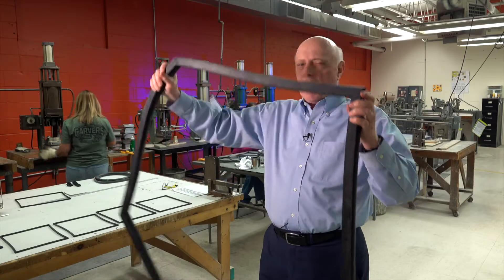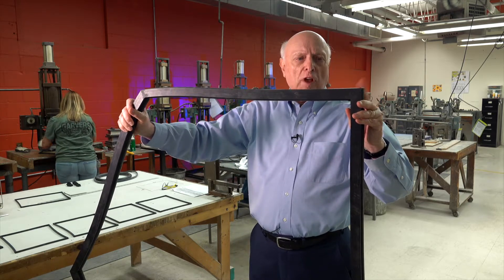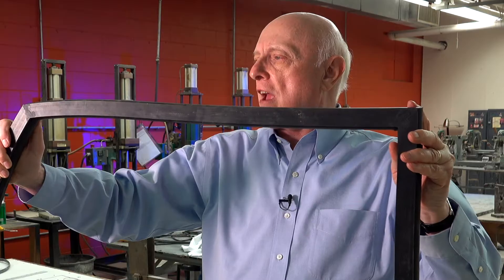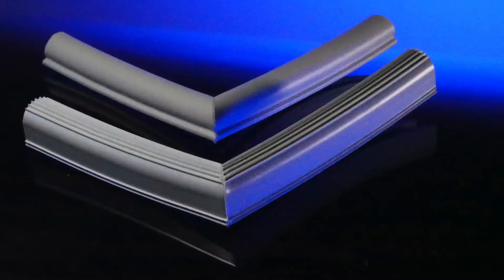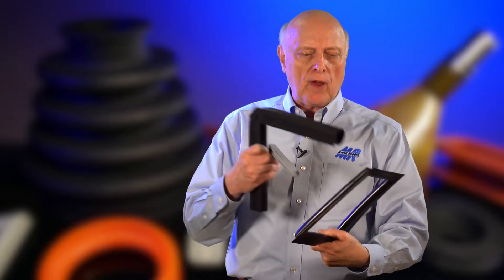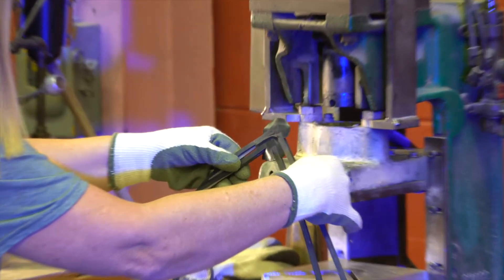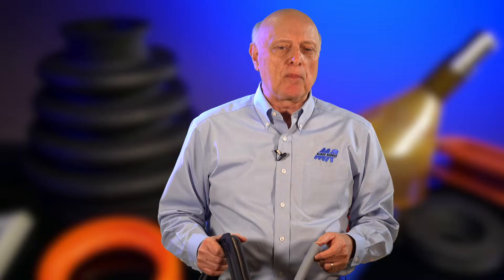Here's an example of a gasket that we've made with a splice corner. It's got a 90-degree angle here and probably a 60-degree angle here. We can do cross sections up to maybe two and a half, three inches by four or five inches. And also inexpensive tooling for this — you have the extrusion die and you have the molds for the molded corners. Your tooling is well under a thousand dollars. A lot of places don't offer all the capabilities that we have for putting corners on extruded parts.